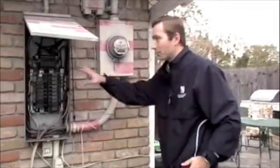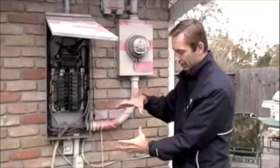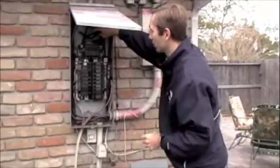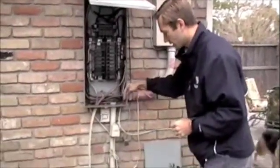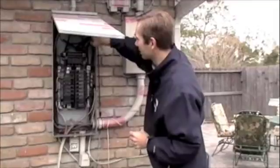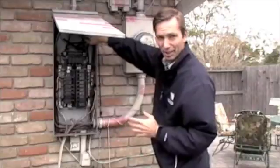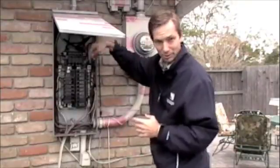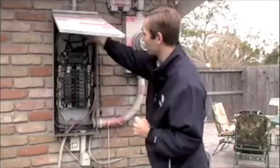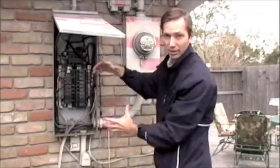In the case that the transmitter doesn't fit in the box, you'll need to attach a plastic box outside of the main breaker box and run the sensor wires through a piece of conduit to the box that will hold the transmitter. One of these lines is permanently attached to the transmitter, so you'll have to cut that line, since you can't run either the clip or the transmitter through the conduit. Then you'll plug two sensors onto both sides of the transmitter to complete the setup.